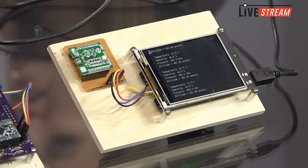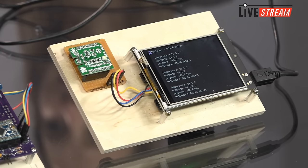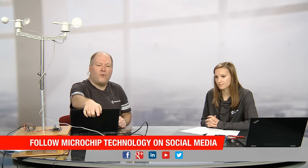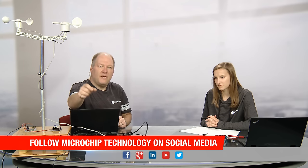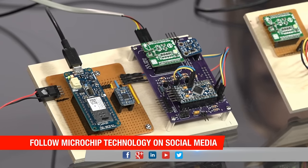They're very fun. So I'm tying in a lot of the maker ecosystem together, right? I've got SparkFun involved here, Adafruit, Arduino, Microelectronica, of course. My intent was to put together an Arduino-powered weather station, but that's been done before. The goal is to make it modular and expandable, especially with that partitioning, because the next step is the middle board. I'm going to be able to take a MKR 1300 LoRa and drop a LoRa node onto that middle board and bring up the LoRa software, and hopefully within a day I'm going to have this whole system on a LoRa board.